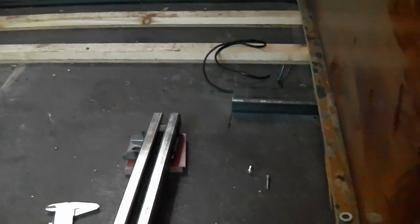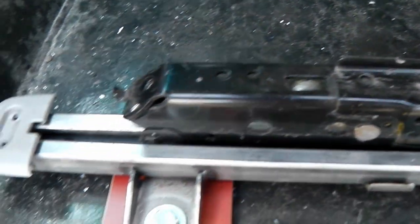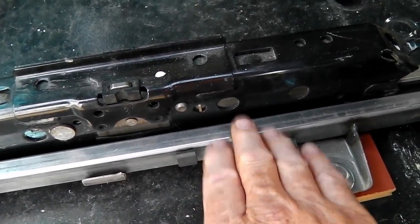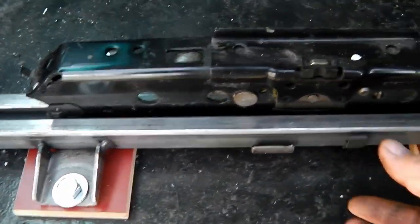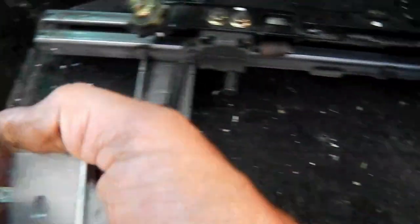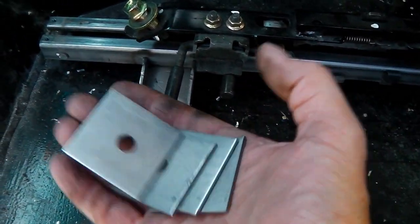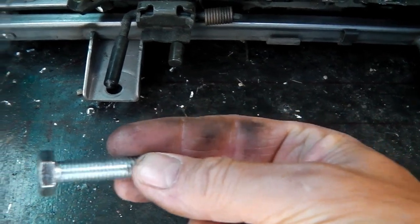So here are the Mazda Bongo floor runners - I've cut them shorter, took them to pieces, took the trim off, cut them down to about four feet, which is how far the seat will go back. To mount them I'm going to bolt them straight through the floor. I've had to make some spacers to get the spacing right for the floor and floor covering that's going on top. One is loosely bolted in as you can see. We're bolting straight through the metal floor and putting some sizable plates underneath from Screwfix - about three millimeter thick. Ten millimeter packing pieces under every single bolt with a flange nut and locking washer on the other side.